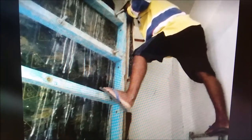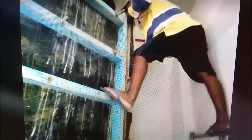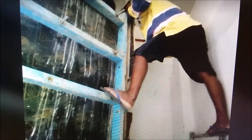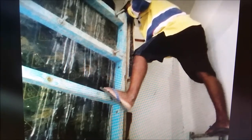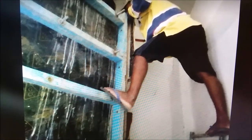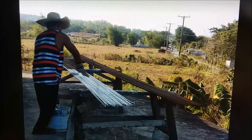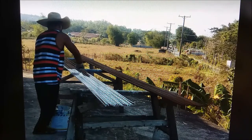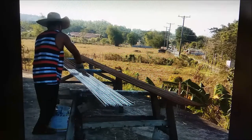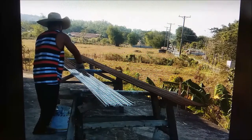I told them that when you knock out the concrete, if you try to knock it clear you can delaminate the phenolic board on the other side. The wood we use here is a two-by-three — it's not mahogany. It's nara. We use nara — pretty much termite-proof, very strong, tight grain. Machines reasonably well, and a carbide blade cuts it pretty good.